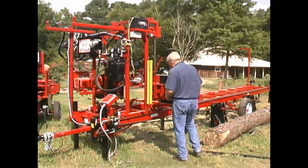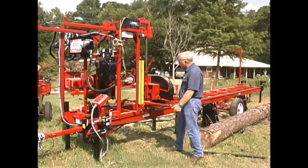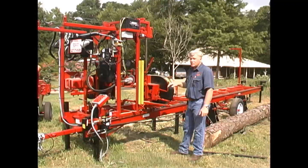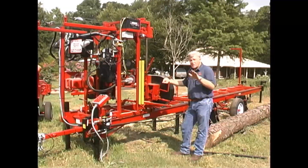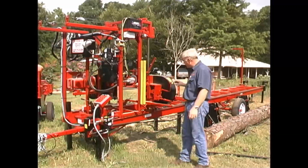You'll also notice it's a four-post head. It is a very stable head. You can't come to this mill and lift that head up and down and shake it. So in the cut, it also is not rising up and down as you will see with the cantilevered heads.